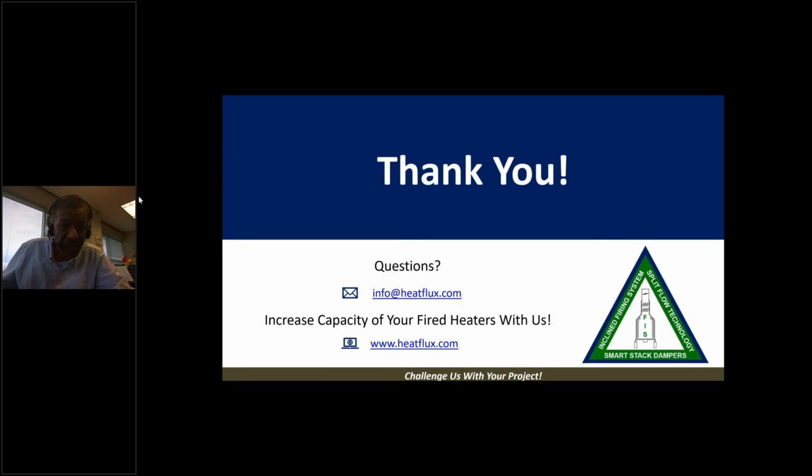The split flow technology appears to be very simple. Why wasn't it considered in the past? Is the control of the split flow critical? What about the draft limitation? So good question, Craig. I think there are so many things we don't know why it was not considered. I think maybe historically it was not needed actually. And the control of the split flow is not critical. We did our first project by just using orifice plates. It is not something which we have to do, but there are some clients who want to have the exact temperature. But if you're not worried about exact temperature, we could just put simple orifice plates and divide the flow 30 and 70, so that it can be done that way.